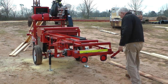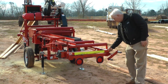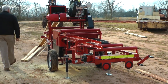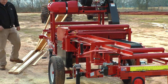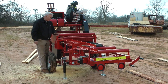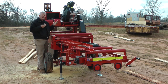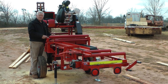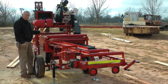We have an e-stop that will kill the engine, and on the far end we have another e-stop as well, so in case of emergency, somebody can stop the machine. I'm going to open the top lid now. We have it bolted down for safety — we don't want people to unlatch and open it up to clean something out while it's running. We want it to be a little inconvenient. You have to take at least one bolt loose before you can open and look inside.